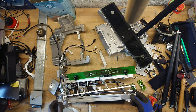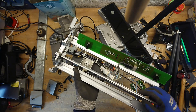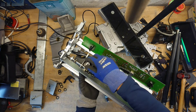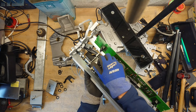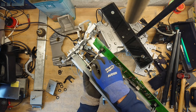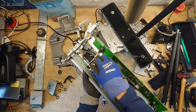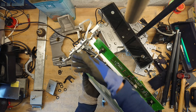Getting down to the heart of the unit, here we can actually see the opening and closing mechanism that is used to let a new image plate enter and open up. Here we can see how it is now closed, and once it has turned enough, the cam does that it slides back. An image can now pass through and be scanned, and as it goes past — to avoid having false light coming in and disrupting the scan — it will then turn the cam again to close down the line again.